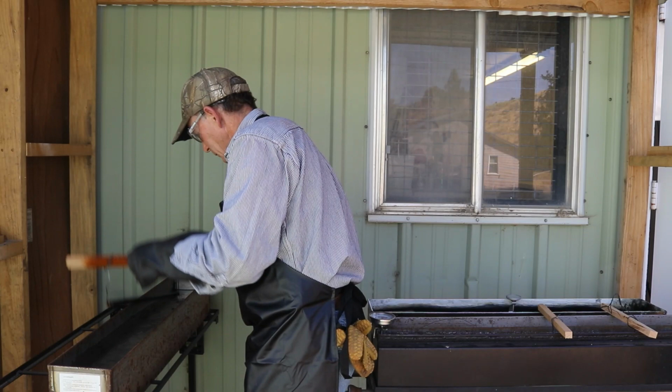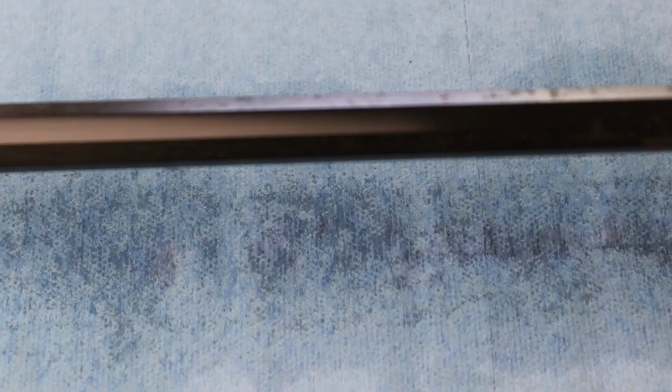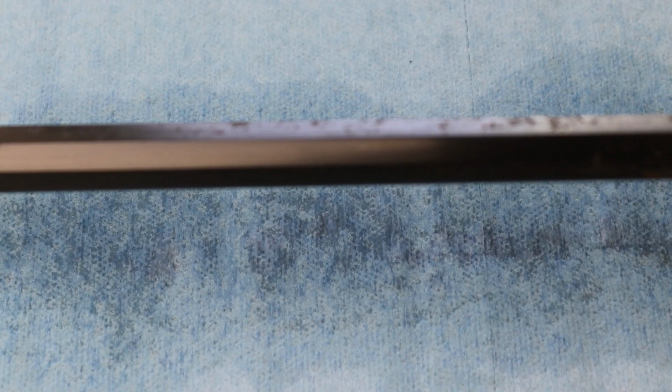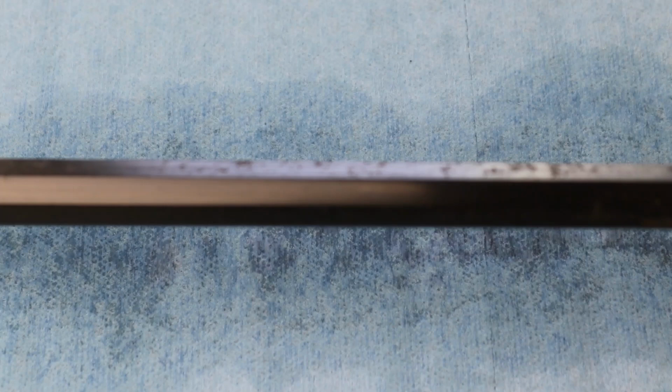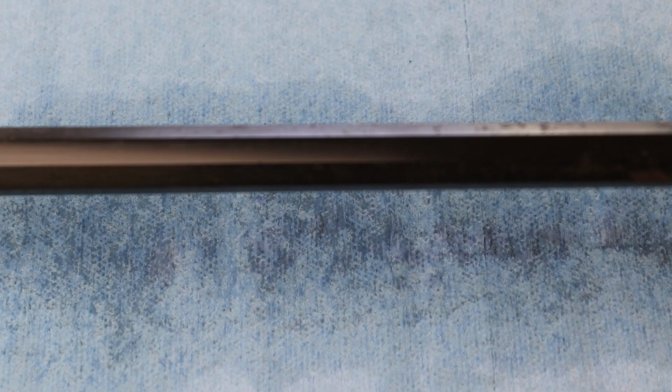Okay. Leave that there. We've got some stuff to take out of the degreasing tank and put into the bluing tank. Now we've hit this with WD-40, and hopefully you can see that deep, dark, lustrous blue on the one flat that my helper got polished up. If we turn it a little bit, you can see the other sides with the pitting underneath, and of course that's a dead giveaway to a re-blued gun if there's pitting underneath the blue finish.